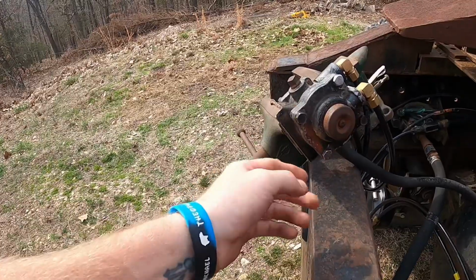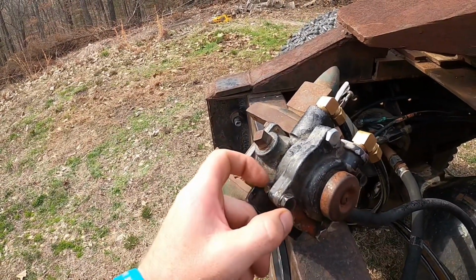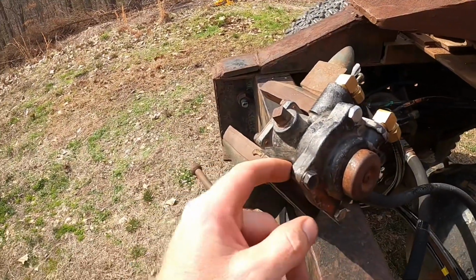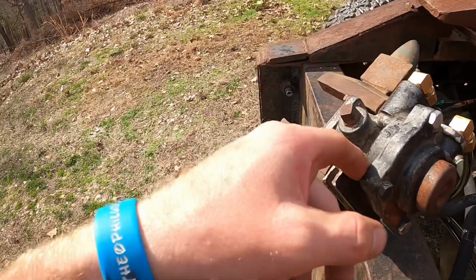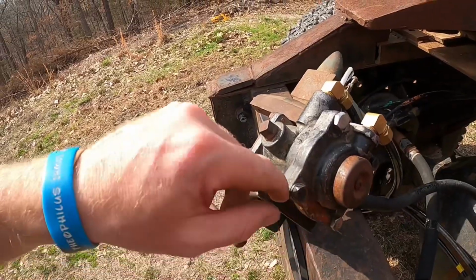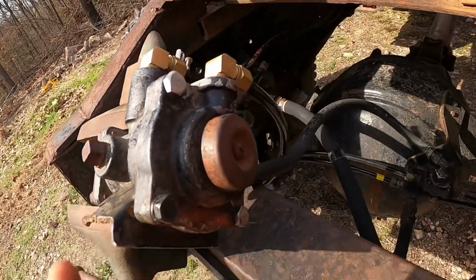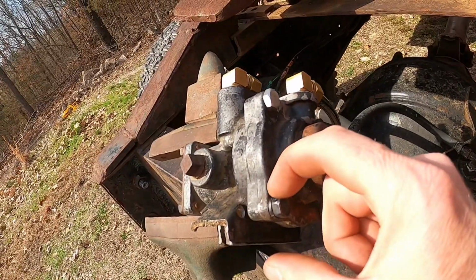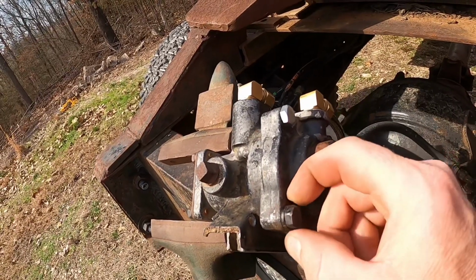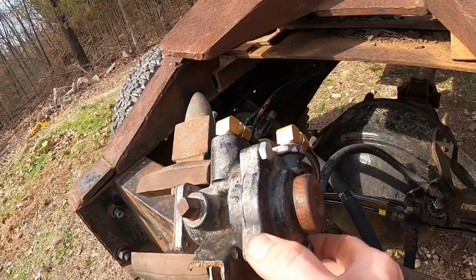It's not leaking. We will build a bracket and get some slightly oversized bolts or cut some longer ones down so that, you know, we can get a full depth inside of the aluminum down here in the threads. But I do want to build a bracket to go on that so it'll work. We'll get something a little bit better too, where the angle will come out like this and it'll have enough room for the bolt head and, you know, not get tangled or twisted.